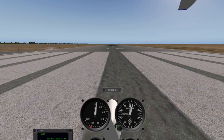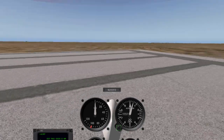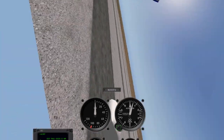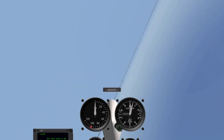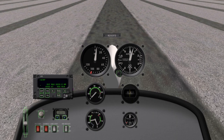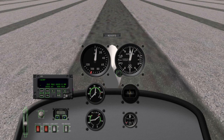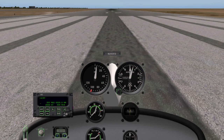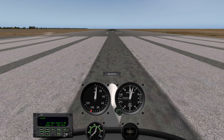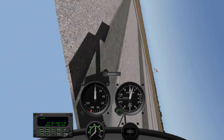So anyhow, we're pre-rotating here, getting up some speed. Looks like it's up there, but the minute you release the brake, it autogyrates, spins under the thing because I don't have any forward motion. We'll try it again. You can see there goes the engine RPM. And come on, pre-rotate. That's the gauge right in the middle and the bottom there. Any second, there we go, pre-rotating. Okay, we're at 50, looks like 150. About 150, it starts spinning around.